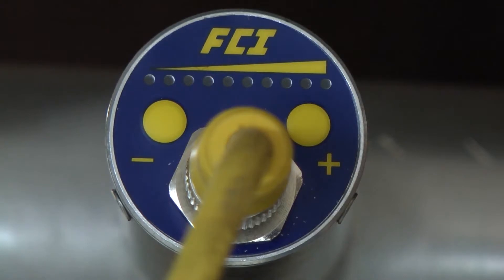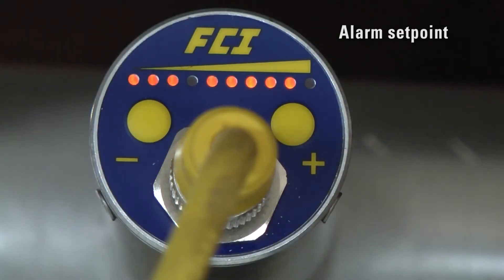After five seconds, the LEDs will signal an acknowledgement that the settings were valid and assume normal operation. The flashing LED indicates the alarm set point — it flashes quickly when in the alarm state and slowly under normal conditions. It is a quick way of verifying the fail-safe is set as intended.